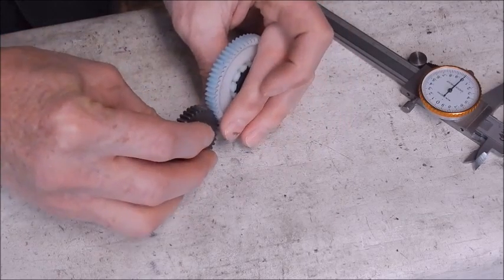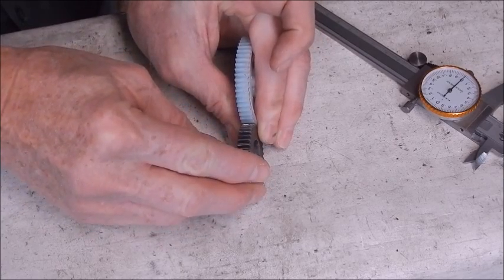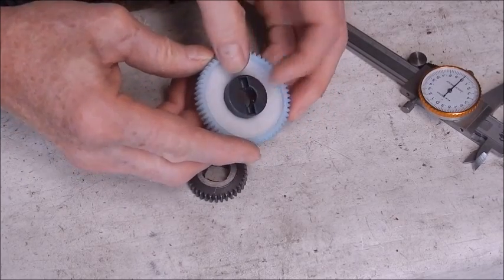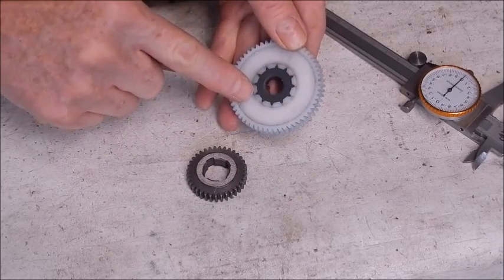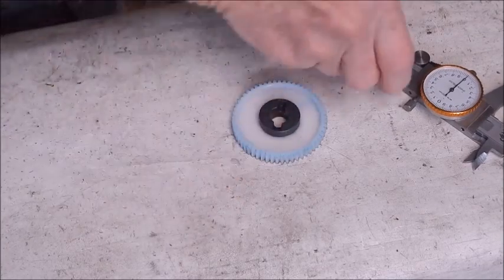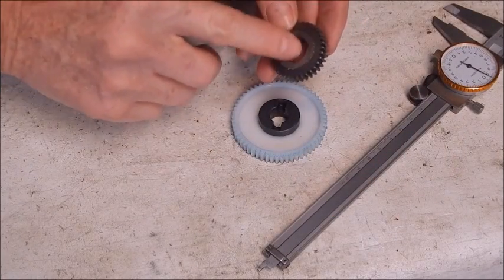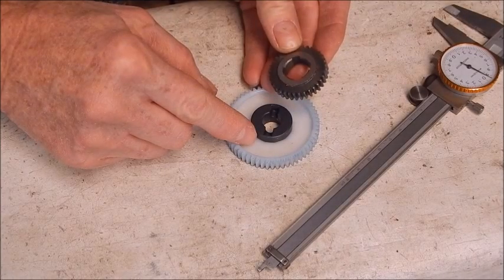It's made out of good quality polypropylene — she fits beautifully, perfect profile, same as the lathe gear. I've machined the plastic back to the usable width we want. The next thing is to machine that center dog section, because it's got a steel or some metallic center star molded into it. I'm going to machine it back to the thickness I need — 10 mil — so I can then cut some splines into it.